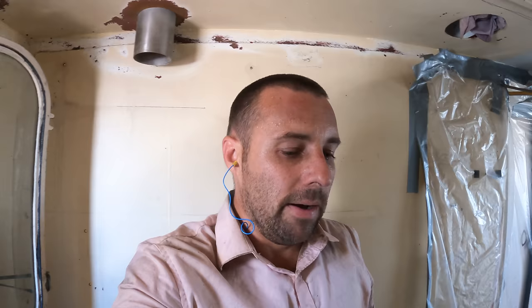Now, they're not sealed ribs, because over the years people have drilled holes and stuck things in them and done all sorts of stuff, so they were always going to rust out on the inside. However, cutting the bottom off, smacking the sides and getting rid of all the loose rust, and then sealing all of those holes will make them into a sealed unit.